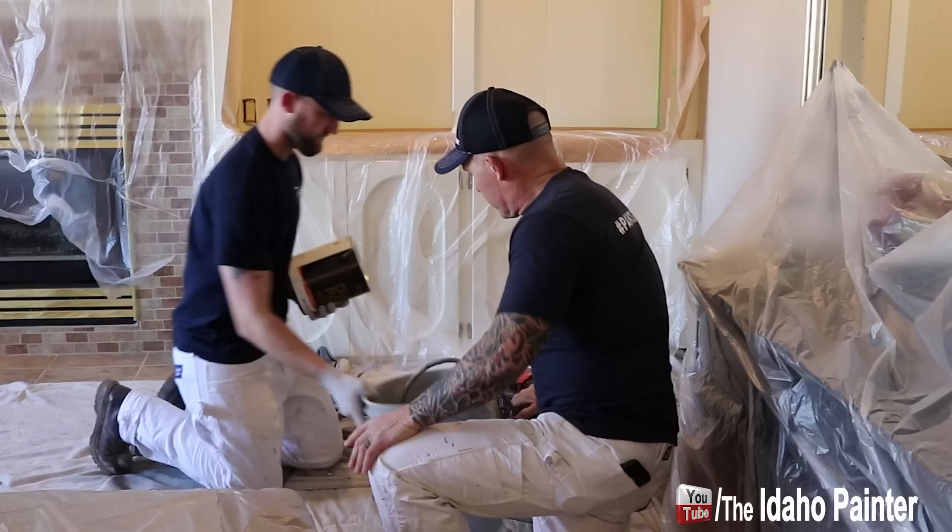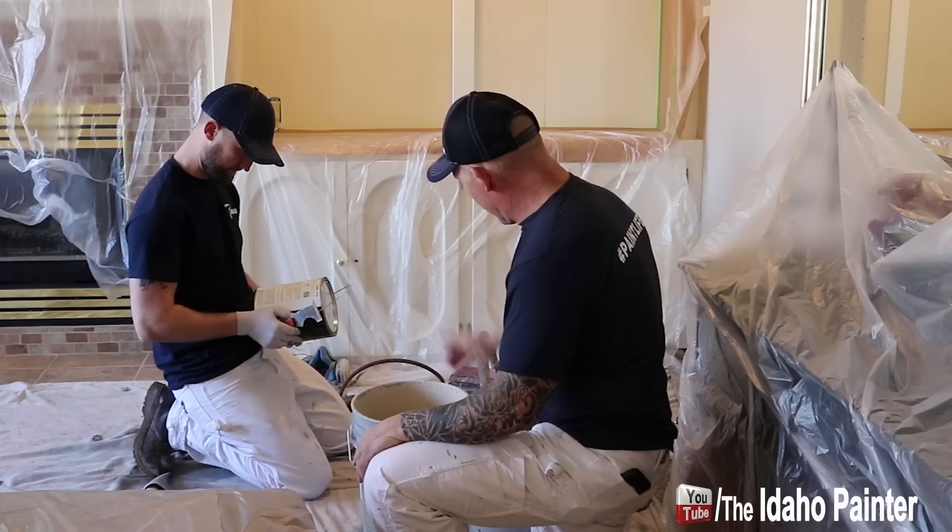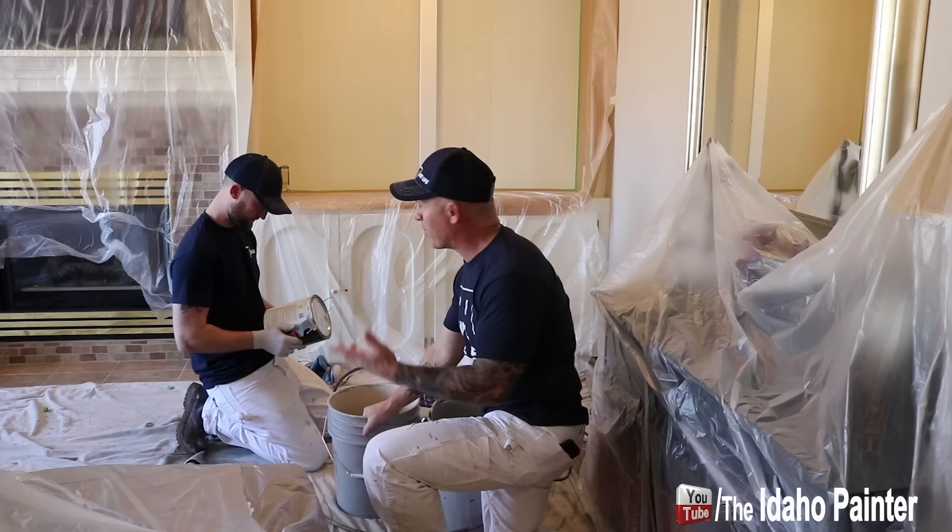Here we are getting this thing set up. We're going to be spraying this with an airless sprayer — I don't think we'll be brushing and rolling it. We've just got two panels back here that we're spraying. Got our can right here. We're going to be setting it up with an airless sprayer. This is a Titan 440 sitting here. We're going to be running it probably about 1800 PSI, right in that range. What tip do we have there, John? We have a 310 tip.